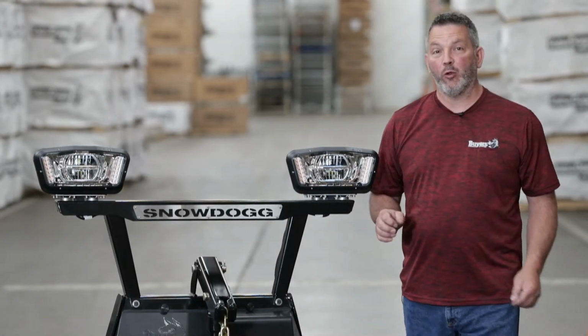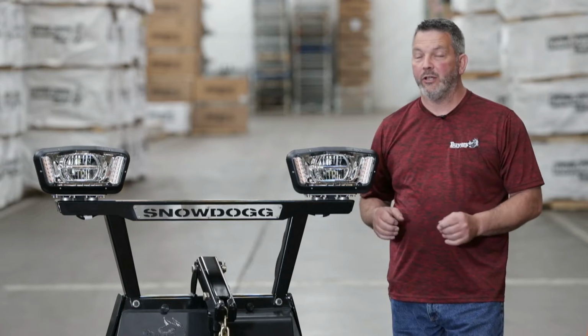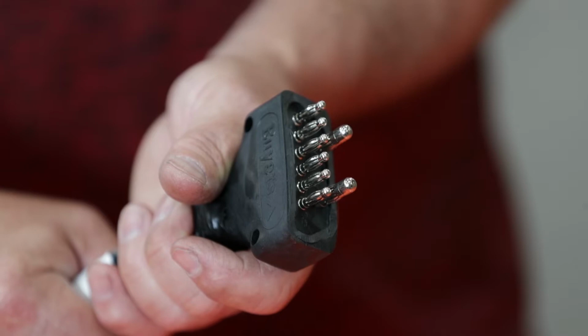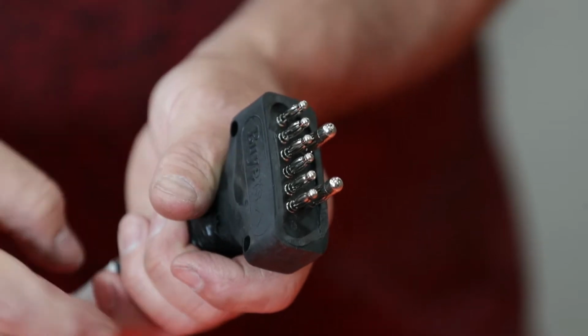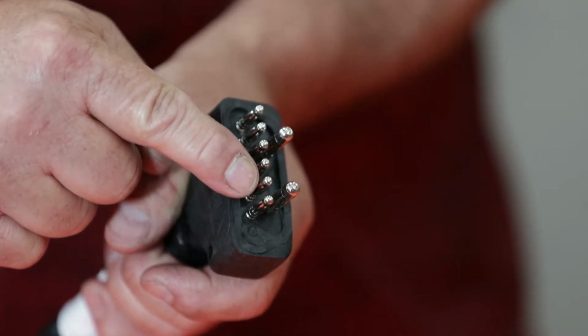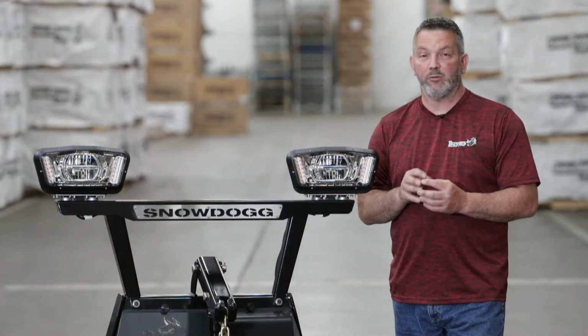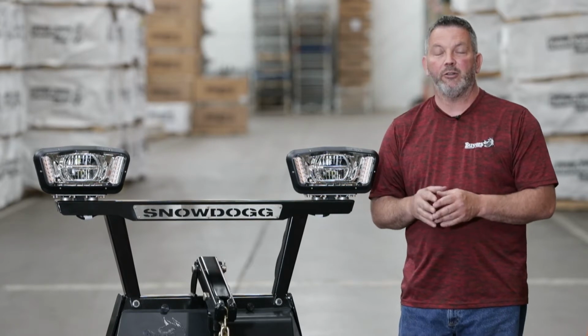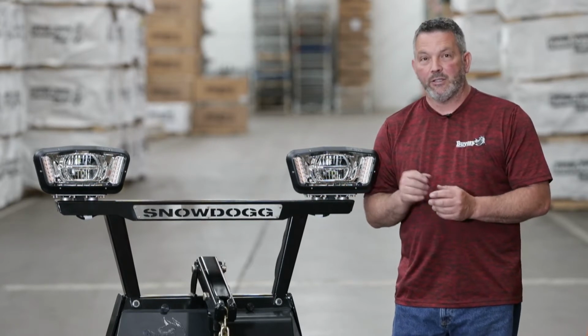In today's video, we're going to be going over the spring cages. The spring cages are very important on our system. What they do is they take the pin and they expand them. If the spring cages are bad, the pins are going to start looking for power and start creating heat, and that's what we don't want. So replacing the spring cages yearly would be a great idea to do, and let's go to a closer view of the spring cages.